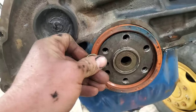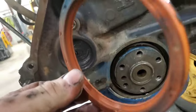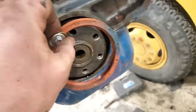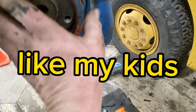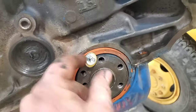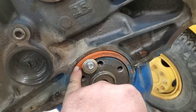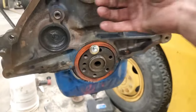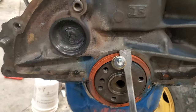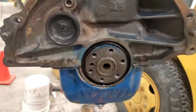If you've never done this before — because the seal, I couldn't quite slide a seal puller in there, it just didn't want to go — one of the things you can do is use a self-tapper with some washers, drill that in through the steel ring, then you take a pry bar or two, take it behind there and pull it out. Works like a charm every time.